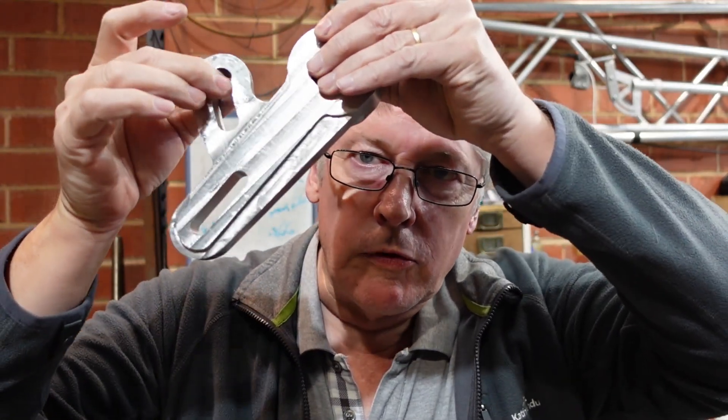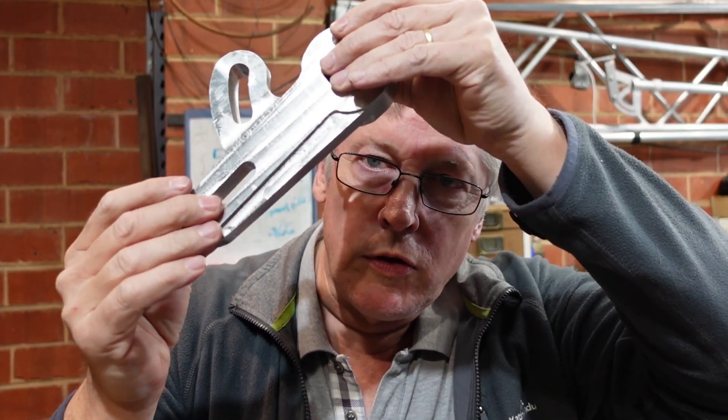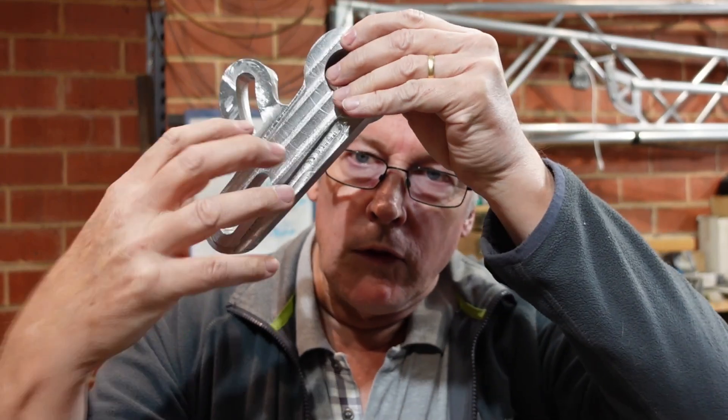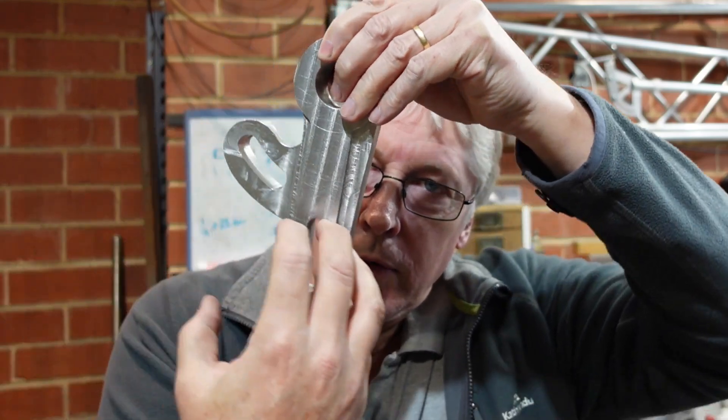G'day. An episode or two ago I was making up some new change gears for a lathe because the original ones had gone somewhere — we don't know where — but there was a second part to that, and that was to make up some banjos to fit them. What's a banjo? Well, that's a banjo there. Basically it's something that pivots, there's a spot for a bolt to clamp, and then there's generally a stud of some sort that comes out of here which gears fit on. You've got a gear here and a gear here, and that gives you some centre distance adjustment. You can also swing that up and down a bit to let your mesh into the gear down here. So they're quite common on lathes and things like that where you're trying to get change gears to work.